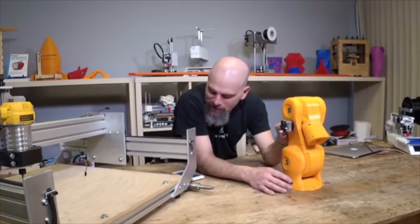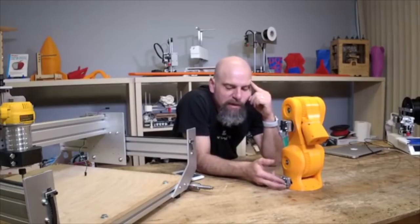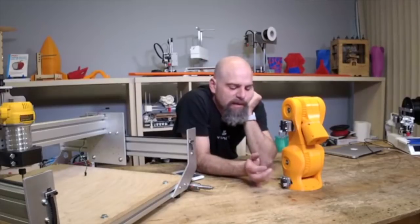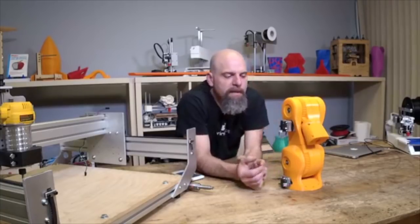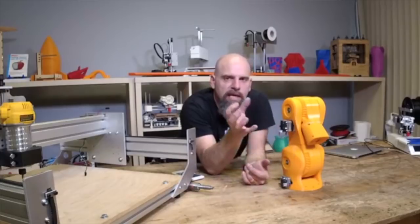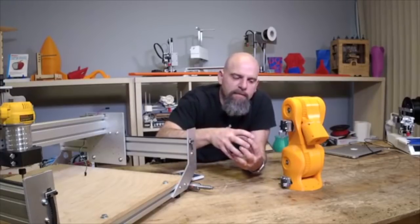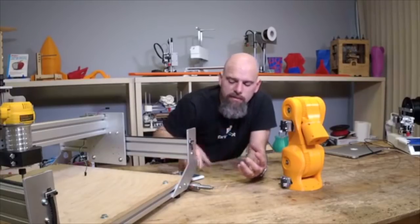And by the way, I've got two other questions, but I want to say one other thing I tweeted about this week. There's this great YouTube video about a guy who is trying to build a robot arm similar to this. The problem really is the backlash on the geared steppers. When you change directions, you always have to eat up a little gear, because the gears aren't super tight. And so it's a little stronger, like a 4-to-1 ratio.